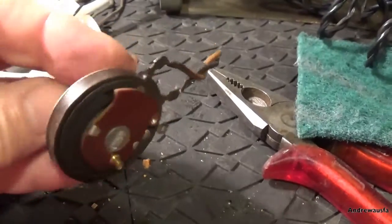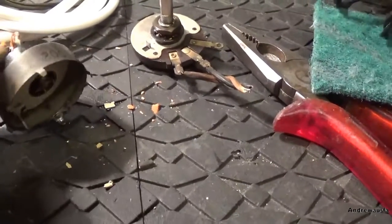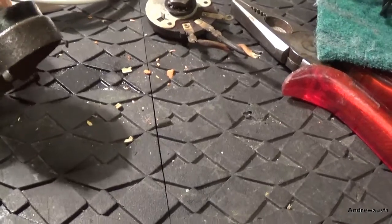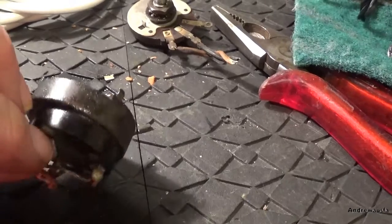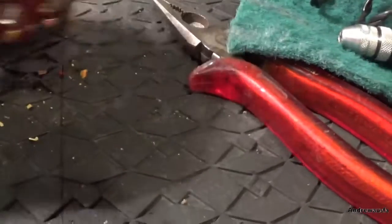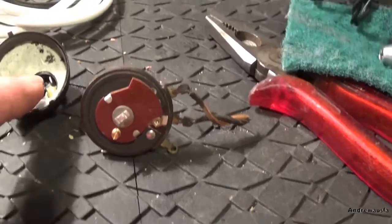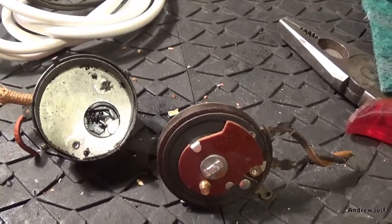This needs a little bit of cleaning up, which I shall do. This outside was actually rusty - I've put a little bit of rust remover on it just to clean it. I don't want to lose that ink stamp though, I might have to. I think that sits at the bottom but I can't really remember, so I'm going to get my wire brush and just clean this up very carefully. When we're finished I'll put a little bit of Vaseline, petroleum jelly on here just to protect the track, and some on here - just like a little grease. It's not that harmful to electrical stuff.